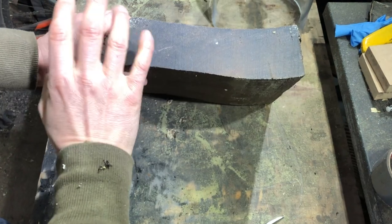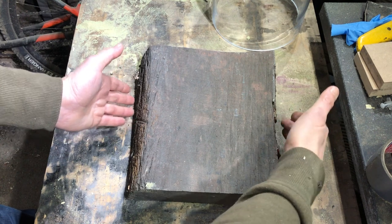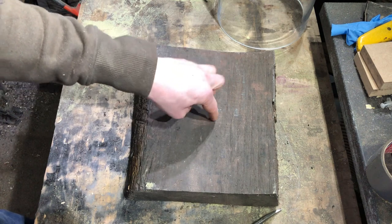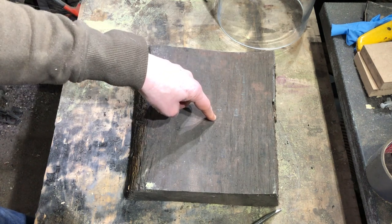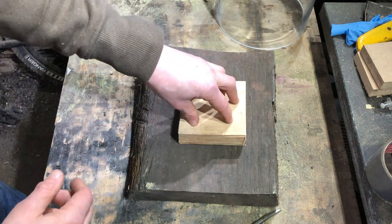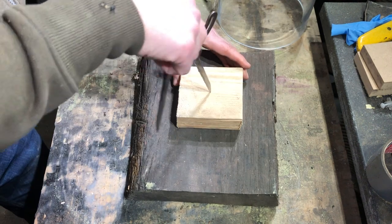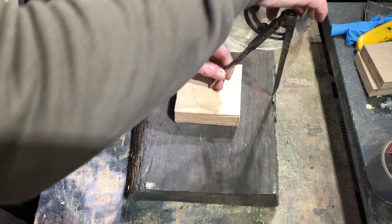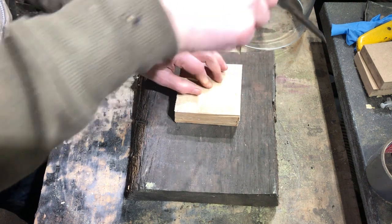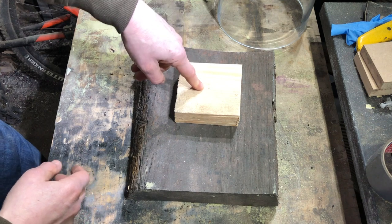Almost perfect - meant to be. Looking at the way this wood has dried, given the bell jar base should be fatter at the bottom and slightly thinner at the top, this will be the top side. I don't particularly want to drill into this with the screw chuck, so a block of wood on top. It's actually fairly evenly matched, so glue straight on there. Just got to find the centre - it's more towards the fatter end of the bog oak. So just glue that on there, leave it overnight to dry, and then we can get on with turning it.